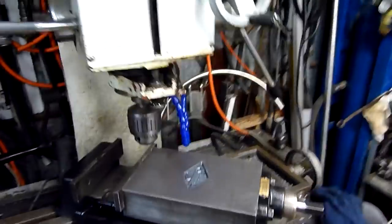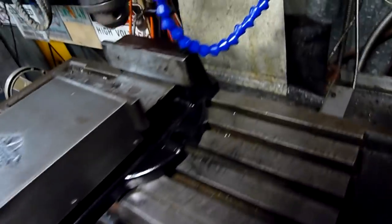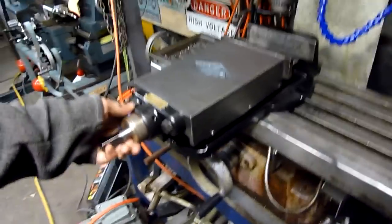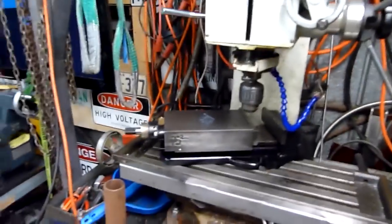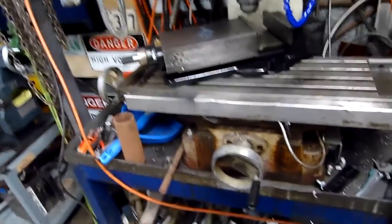The paint sort of peeled off the logo on the center there, but it's not really important. The main thing is the base is painted and clean and she's actually in pretty good order for such an old vice — I'm guessing it's 1950s or 60s era. I'm gonna position it right in the middle of the table and bolt it down and see how we go. I've only got limited travel on this milling machine so I need to align with the T-slot. Anyway, thanks for watching — it's a cleaning up and restoring of a rather old but still useful milling vice; it's definitely a lot better than what I was using before.